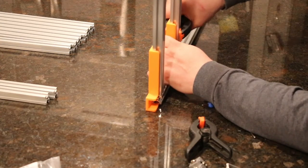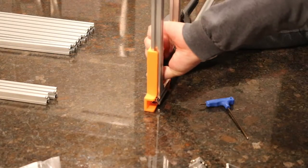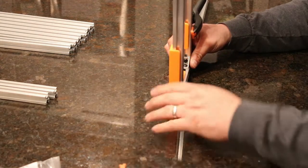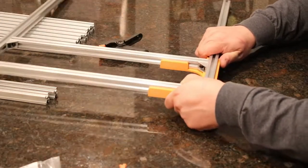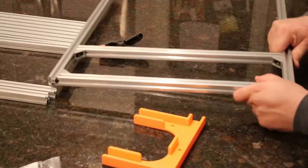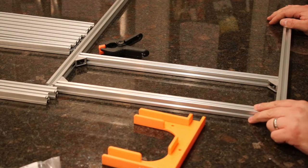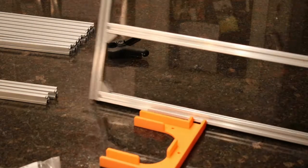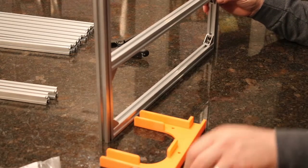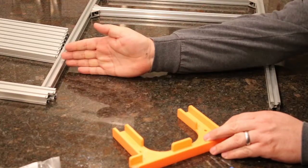Put a clamp back on, make sure it's pushed down firmly, and put another clamp here. Install the corner bracket right there. Remove the clamp and carefully push the jig off. Check the flatness — this is built nice and flat. Before going further, we want to reinforce this a little more. To complete this side, you need to put extrusions in this corner and this corner also. Now we're going to use the tool in another orientation to set the spacing of the bottom beams.